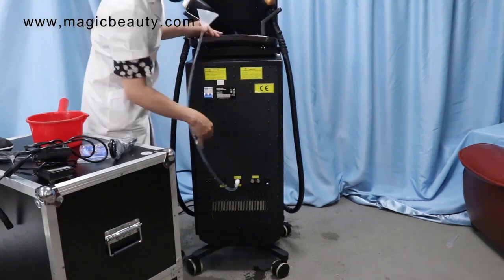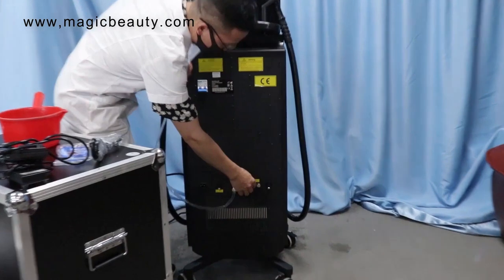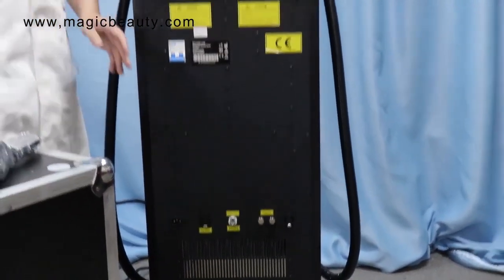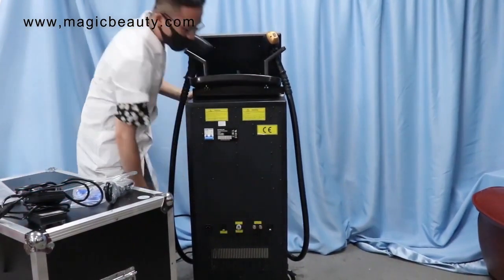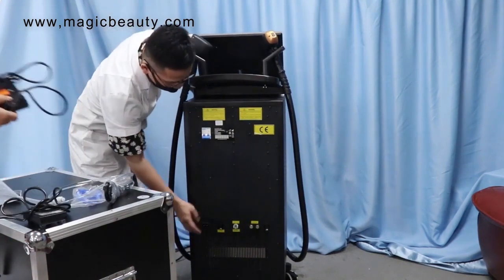This is for the best cooling system. So this is the step to add water: use the funnel, add water until it is coming out, and after that remove the funnel. This is the step for adding water before you turn on the machine to do the operation. And make sure to cover back the overflow hole. After that, connect the power cord.